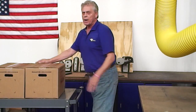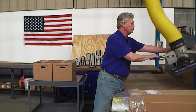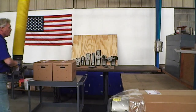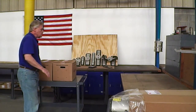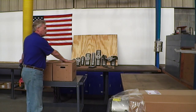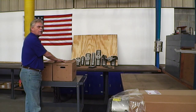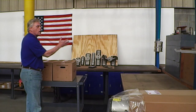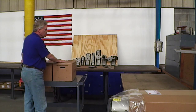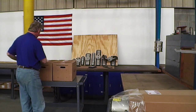Now I'm just going to lift the box. Now, typically when we put our suction feet on the box, we'd like the suction feet to cover as much of the surface area as possible. The more surface area you cover, the more the porosity of the cardboard will have an effect on the lift, however. And the strongest part of any box is always the outside shoulders.